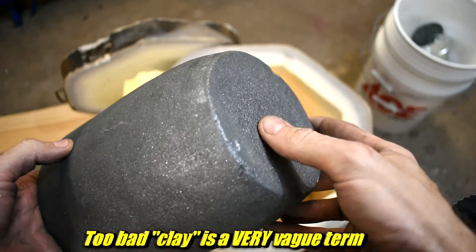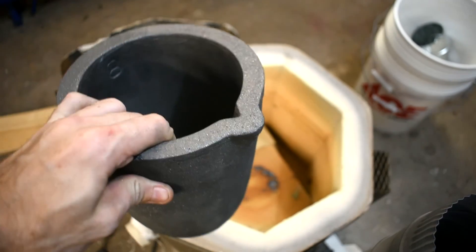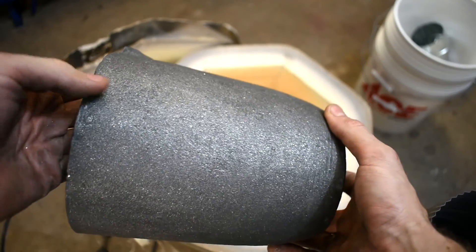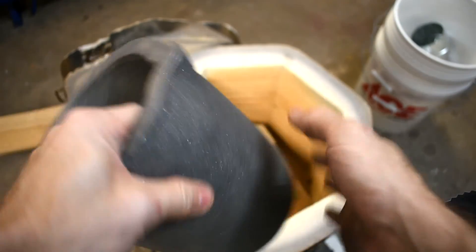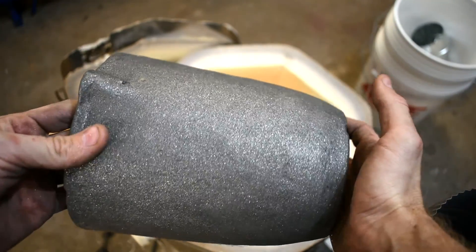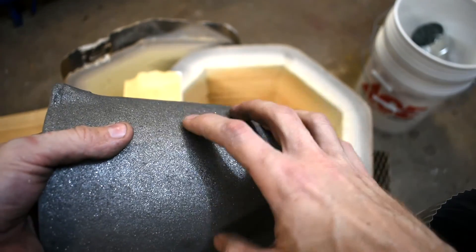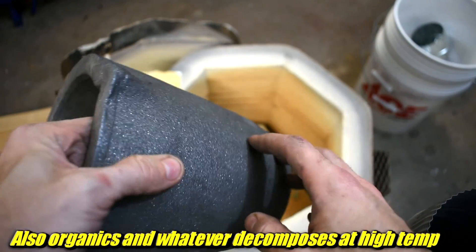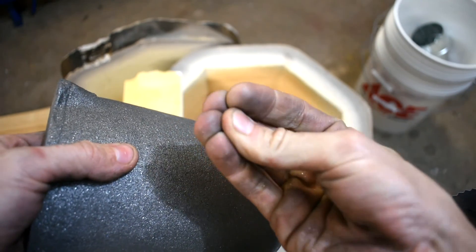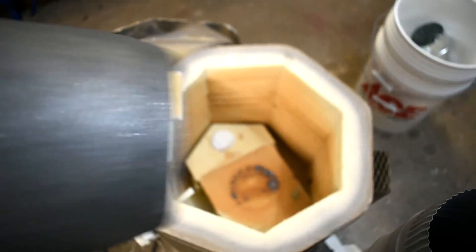I don't think it's a major stretch of the imagination. I'm assuming they have this clay mix that can handle thermal shock, and they press it in a mold. It comes out of the mold, they probably do a low fire which burns out any residual moisture — not just surface moisture, but chemically bound moisture. And then it basically sinters all the particles together so they're stuck.